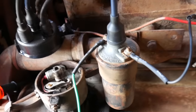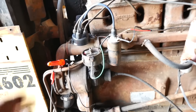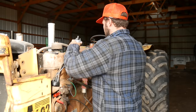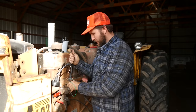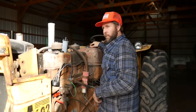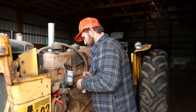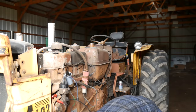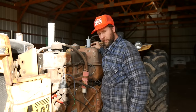So, suspecting the coil at this point, and I did bring one, so I'm gonna go ahead and snip that out and snag a new one and then try the whole setup again. Hey, you know, a guy's not quite sure what it is, but it seems like everything I touch either has no spark or no brakes, or both. The model is the cheapest the parts store has. She ain't slipping here. Well, can't ever get nothing done because I'm dropping everything. This should be the easiest thing to do right now, and I'm just struggling with it.